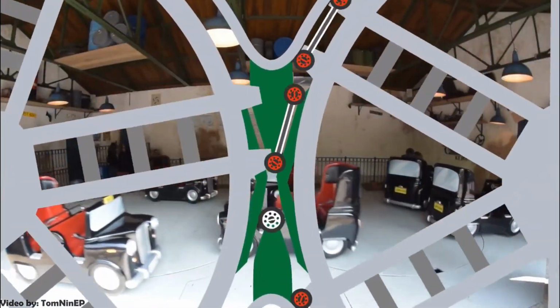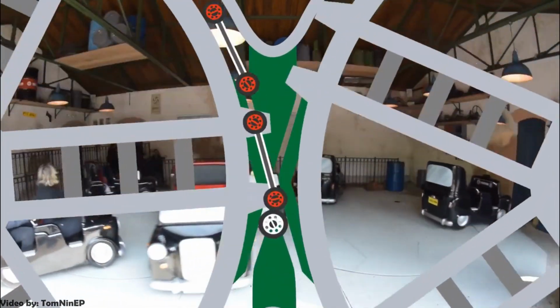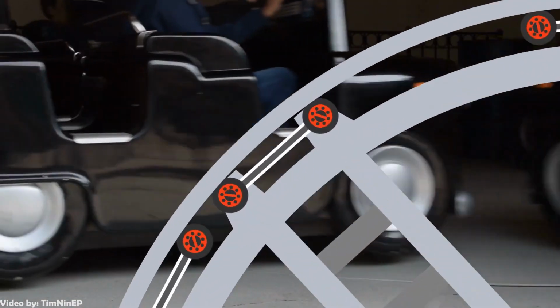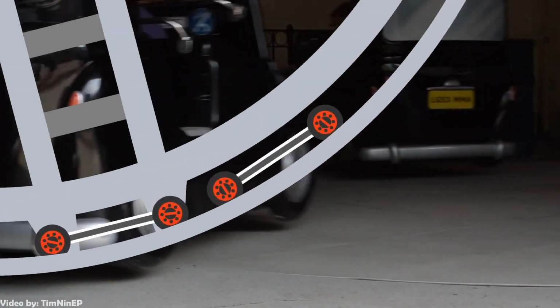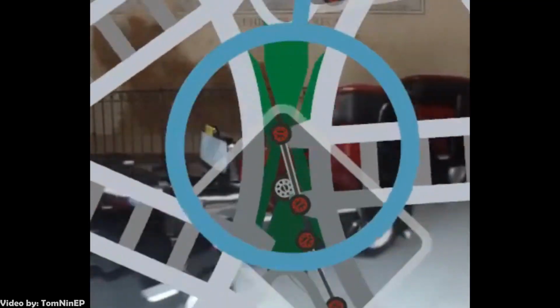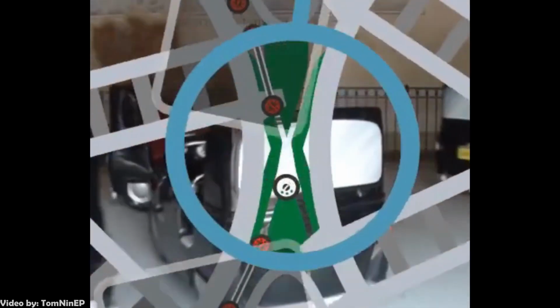When a vehicle reaches the handoff point, where it's handed off to the next turntable, a toggle wheel flips left and right, directing the pair of fins from one side to the other. The wheels on the sides of the shuttle bars and fins run inside a circular channel that helps them follow the turntable around. At handoff points, the channel suddenly becomes a straight line that points to the channel of the next turntable. At this point, the channels form a slim X shape, which directs the vehicles off.